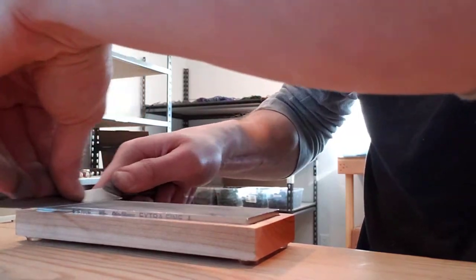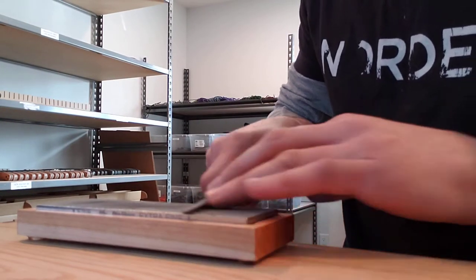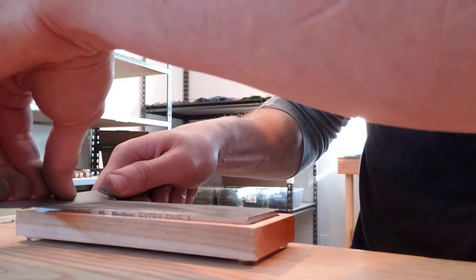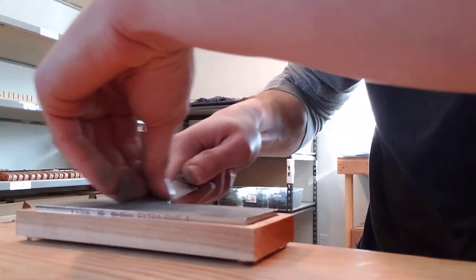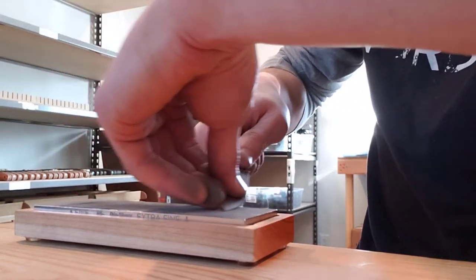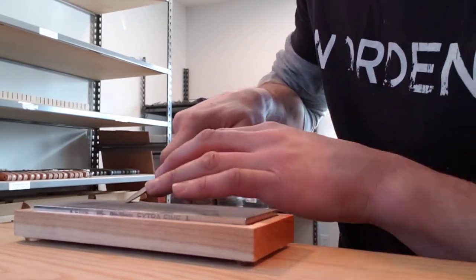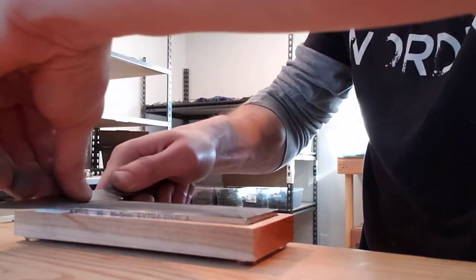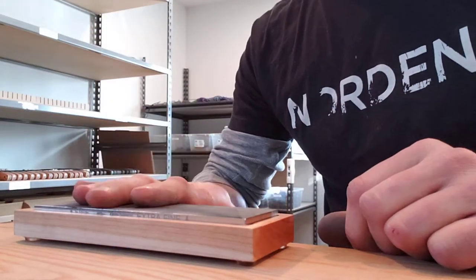I'm grinding on the forward stroke and on the back. You've got to remember this is hardened steel. Most people struggle because they do light strokes when they're sharpening — but when you're sharpening you're actually removing a lot of material. You're trying to remove hardened steel, and that's why most people can't get a knife sharp on the stones — because they don't really put the elbow grease in. You should not have to do this often; you don't want to come back to the stones like this unless absolutely necessary. This grinds away material — you should do this as little as possible. I know from experience that I've reached the apex on both sides with this stone.